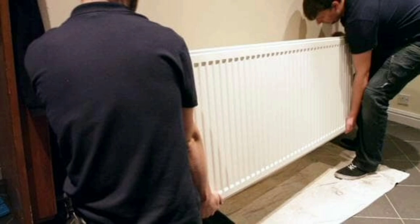Final tip on radiator removal: depending on the size of the rad, you might need to get your labourer or somebody to give you a lift off the wall so you can empty the radiator. If it's a small radiator you can normally do this yourself — have an empty plastering bucket ready and some tarpaulin or plastic sheeting on the floor. Choose which end you're going to tip and empty it out into your plastering tub. I then normally flip the radiator upside down so the pipes are at the top — no risk of that nasty black dirty water leaking out anywhere.